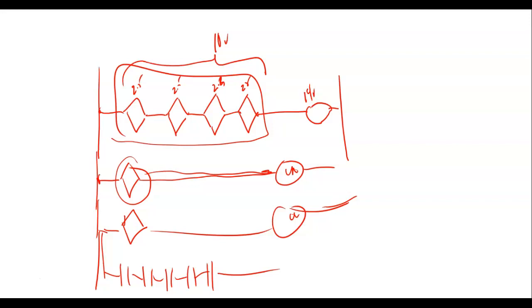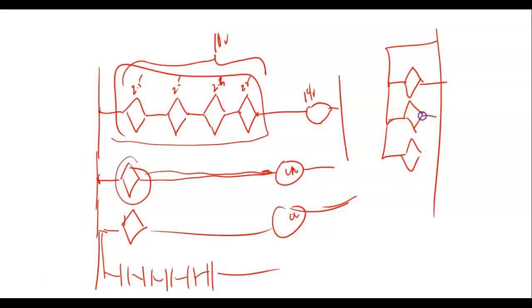And a PLC, this would make no difference, because what I would do is assign each sensor to its own input anyway. So each sensor would be assigned to its own input. And then inside my control logic, when I programmed it, I would program it like that. So PLCs, it's no big deal about hooking things, because each one of them has their own input, and then you program the inputs how you want them to work.